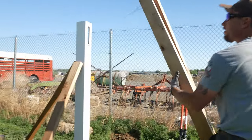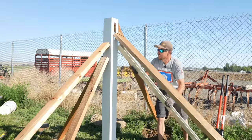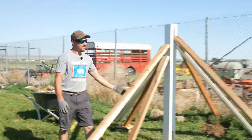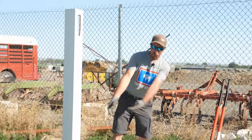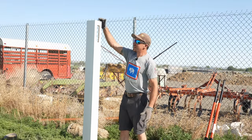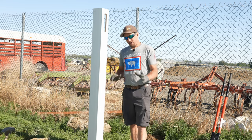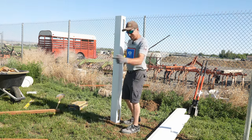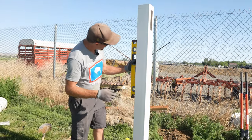Let's get some bracing because we've got to brace this thing up. I can already feel the wind coming. You see how ridiculous this bracing looks? You don't need it — that's a wasted step, don't do that. That's what the dirt's for. It doesn't take long for the concrete to get hard around the post to help it stay uniform. I'm pulling quite a bit of force on it and it just bounces right back to its natural position. If you're convinced it needs a little more, just step on your dirt a little bit — that'll hold it in place just the same as bracing.